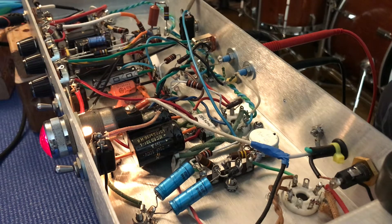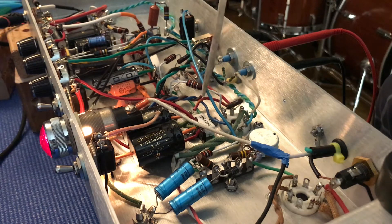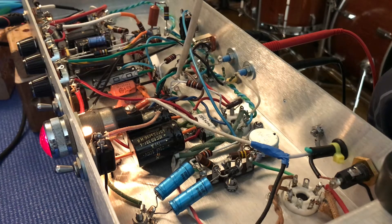Here's the switch right here. It's the cathode bias resistor and bypass capacitor I installed, and the fixed bias network right there that provides the negative voltage needed to go to the grid.